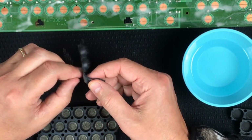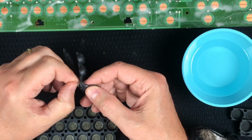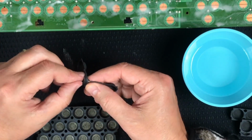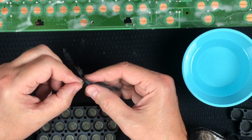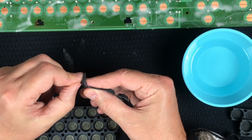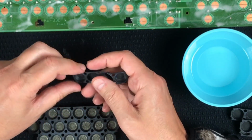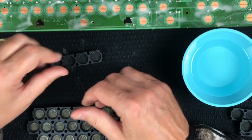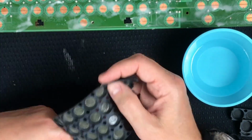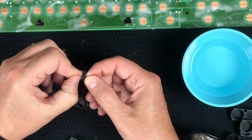I meant to show off, I was using Meshmixer and working on a keycap stem mod, and then I realized I was a dummy, because every time I made a new revision, I had to start over from the solid. I had to start over again with my 2D layer, change the dimensions, and then build up the solid again. Then I realized after some internet searching that that's what real CAD programs are for, parametric modeling, which lets you, after it's a solid, still change the dimensions, and it just does the right thing because you defined all the relationships.